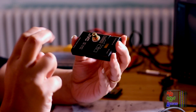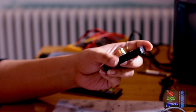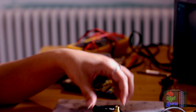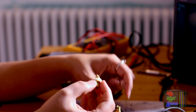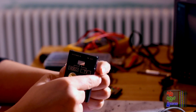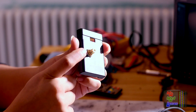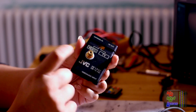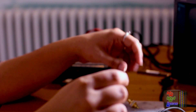Okay so that's the video sorted. I need to make the audio connections now. I don't have a yellow RCA — I've only got black and red. So I'll put the white plastic on the video one since it says 'video' in big letters on it, so at least there's a big clue on that. Then I'll do the audio ones.